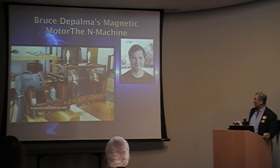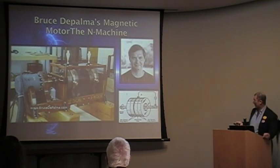This generates low voltage and high current, so you can generate a magnetic field with this. This is the basic concept. You have ferrite rings, which you can take from speakers, and they're very heavy magnets, south, north, south, north, south, north, south, north. And you have a conducting ring, copper disc. It's basically a variant of Michael Faraday's unipolar dynamo. You can extract negative from the periphery, positive from the hub, and there would be your voltmeter. So you have this conducting disc, ferrite magnets on either side.